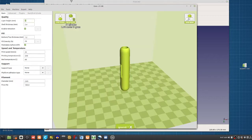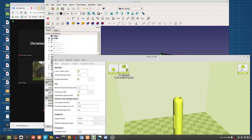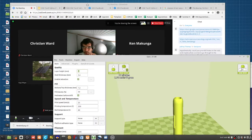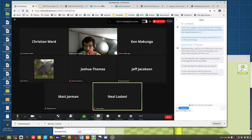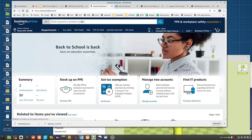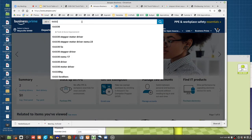So yeah. Today we'll actually get out the large stepper drivers here. If you want to replicate this experiment at home, if you have a universal controller, if you want to use the ramps system from another 3D printer to actually run larger machines, you can. If it's running Marlin, you can readily control other machines. So all you need to do is go to Amazon.com or someplace like that, and Google up TB6600, and you can get one of these things